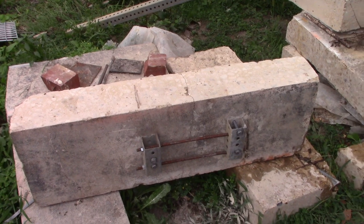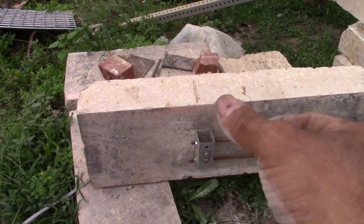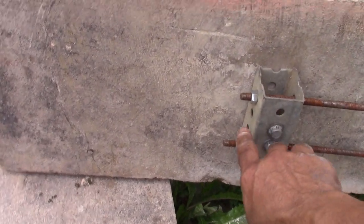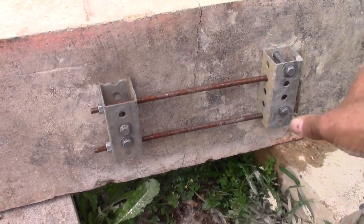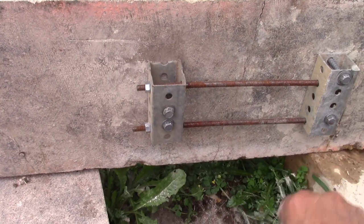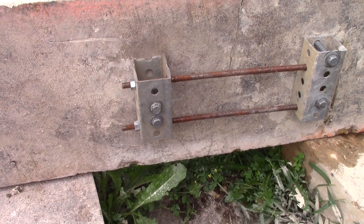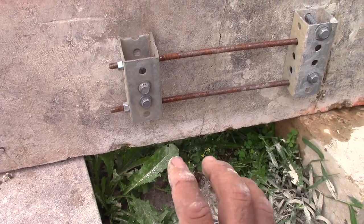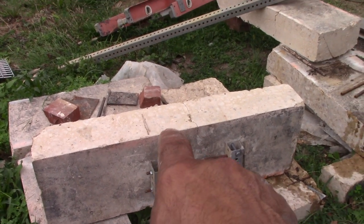Post-tension bars, clamping, redundancy. Not just one and go, that's it. Add the redundancy. Add the other bars beyond this one, not just through it, because if this fails somehow, it might want to cut your bar. Have it on the outside of it. Redundancy, another track. So this would be a primary, and then your secondary would be there to help transfer the loads also. This is beautiful. This is what I envision when I see external post-tensioning on these structures like this.